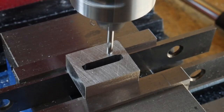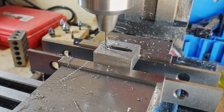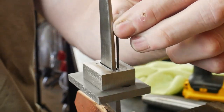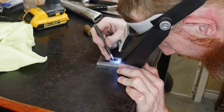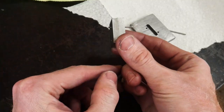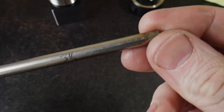While I will be epoxying this knife together at the end, I wanted to build it as a takedown knife so I could practice my takedown hidden tang construction skills. To do this I drilled one-sixteenth inch holes and used hardened dowel pins between each of the major components of this handle. The first step was to drill holes through the spacer and then use that spacer as a guide to drill holes into my guard — drilling these sixteenth inch holes halfway through the guard so the spacer indexes to it the same way every time. Later I drilled holes into the wood on the other side of the spacer so the dowel pins hold the entire assembly nice and rigid.